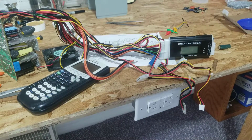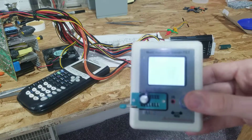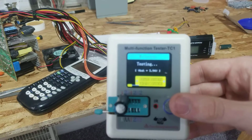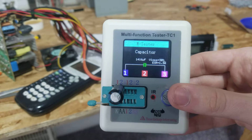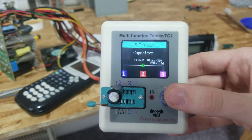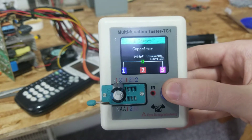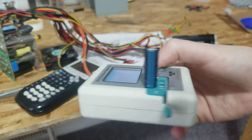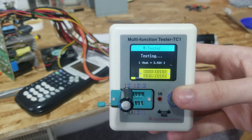And this is kind of funny, because when your capacitors test like this, you know they're bad. Focus on that. Oh, quite strange. Okay, well, we have 1,500 microfarads, 30% voltage loss, and ESR of 1 ohm. This is supposed to be 3,300 microfarads. Let's try it again. Hopefully it'll have the little funny thing that happened.